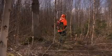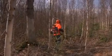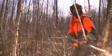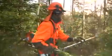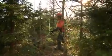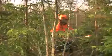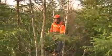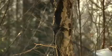The backpack chainsaw is highly effective when spacing low shelter wood. After spacing, the deciduous wood functions partly as protection from frost for the spruce plants and also helps reduce the occurrence of stump sprouts. With its greater reach, the backpack chainsaw has an advantage and saves its operator many steps around the stand when spacing the same area. This is because the operator no longer needs to go right up to each stem before performing the cut, since the reach is about 2 meters both horizontally and vertically.